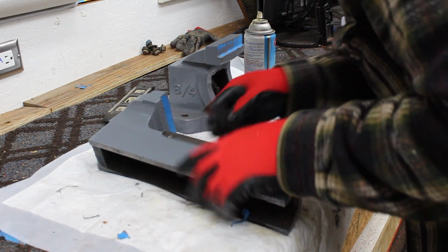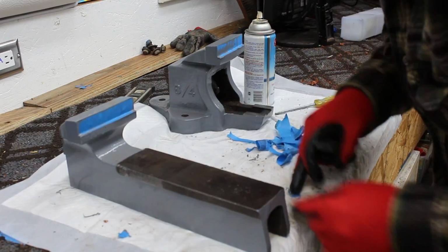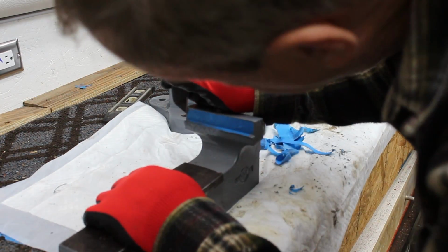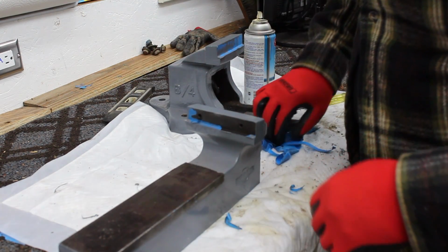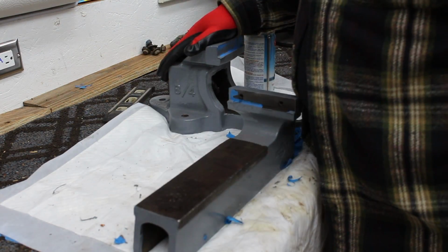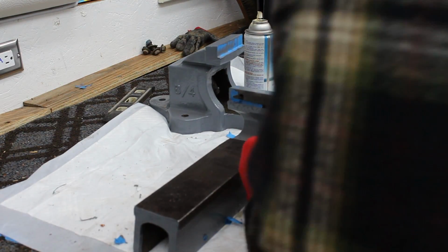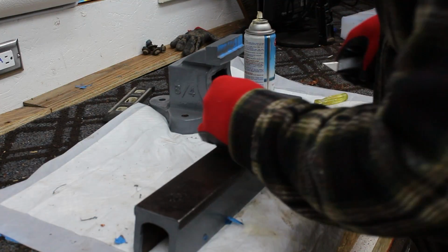You can see this, even this slider portion of the movable jaw has taken a lot of abuse over the years. There's a lot of hammer dings back here where they used it, unfortunately, like an anvil, which is the worst thing you can do to a vise, is bang up the rear end of it. But the first one I did, it was so hammered and then ablated that the back end here wouldn't even come out of the stationary jaw. And so I had to actually put the whole vise in the mill and actually mill the sides and even mill the top. Somehow it had been banged up so much that it just wouldn't even come out. And only until I did that, then it finally came out and I was able to fix it up and clean it up. And that's actually my main vise that I use over here on the roller.